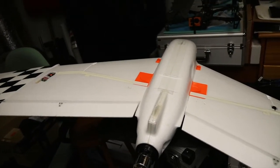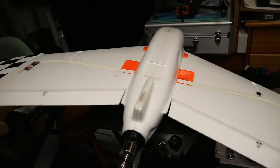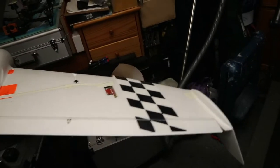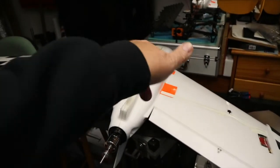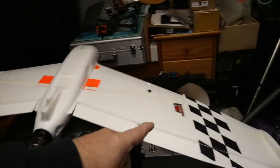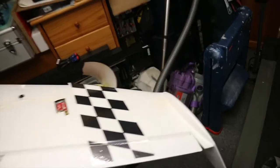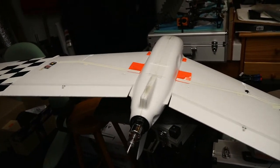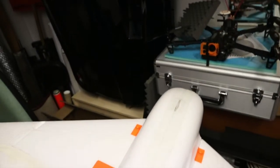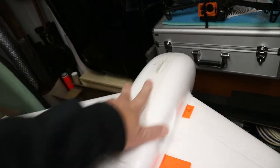It's starting to take shape now — it's all set up, enabled on my transmitter, all the features are ready to go, and I'm getting quite excited about test flying it. After I had set up the plane and all the pieces in, I checked the actual balance on its horizontal plane and found it was slightly heavier on one side, probably because of the weight of the VTX and antenna compared to the receiver. So I had to add a small weight under the tape there to give me that lateral balance. I've taken all the boxes so far and tried to do this belt-and-braces. I put a bit of fibre tape up there because that's going to be scraping along the floor, and I put some wing skids in there so when it comes down they'll slow the landing as they bite in.